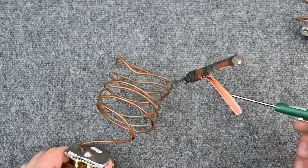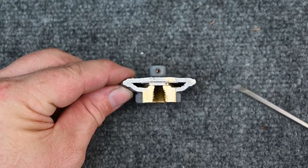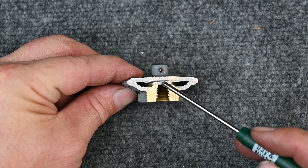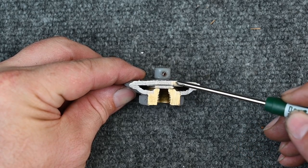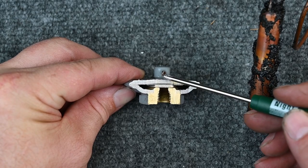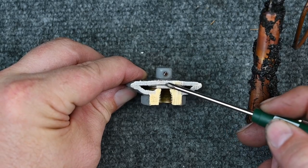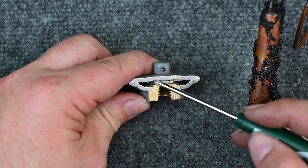The power head is where pressure pushes on a top plate that moves back and forth. That plate barely moves — just a fraction. The refrigerant fills one side of the power head: as sensing bulb temperature rises, pressure builds and pushes the plate downward. As temperature drops, pressure reduces and the spring plus suction pressure push it back. Very little movement, but it makes a huge difference in how much the valve hole opens and closes.